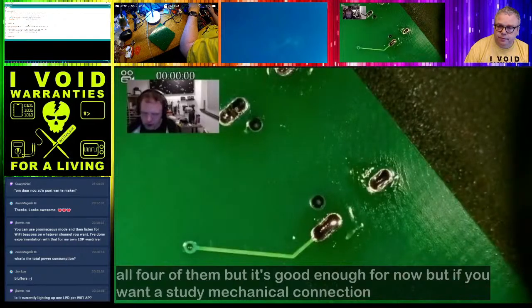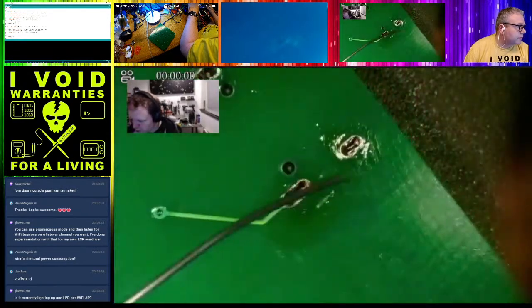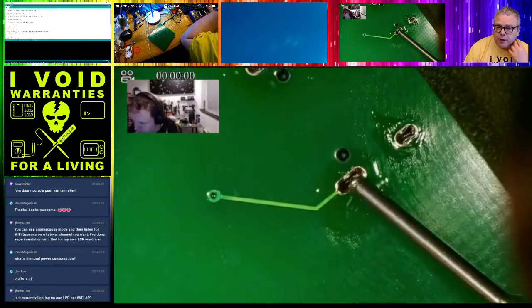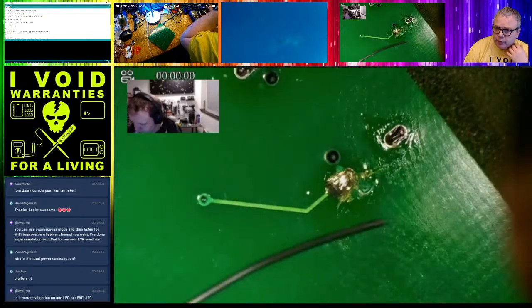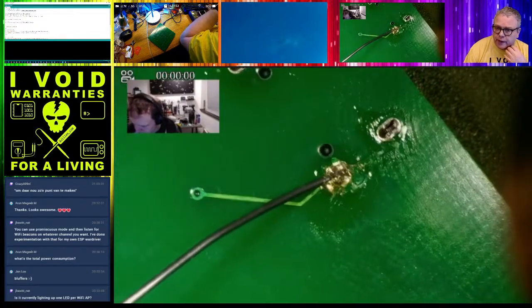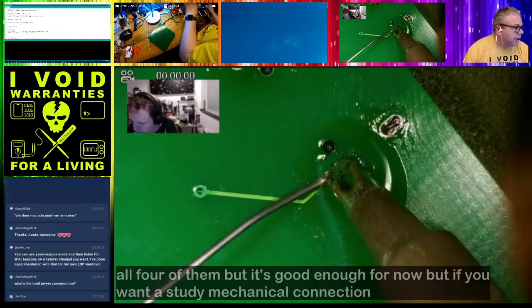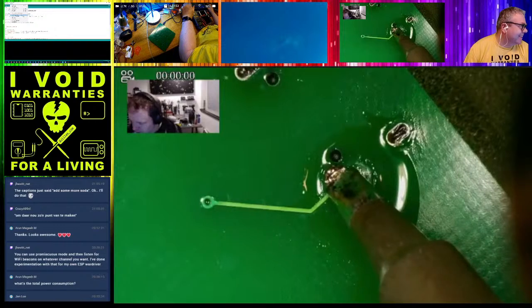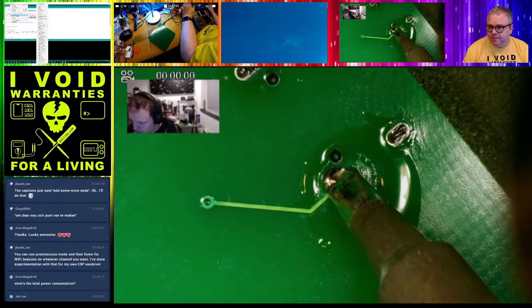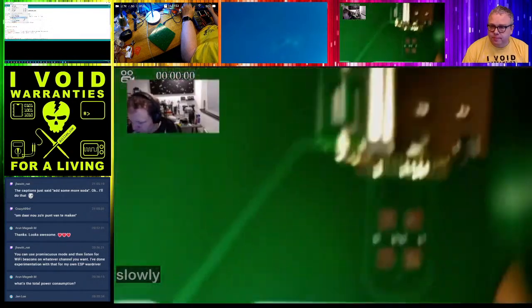And just more heat. The thing is that this USB-C connector takes some time to heat up, and then it'll suck in more solder. Yeah. And sometimes you just need to add some more flux, and you'll see it nice and bubbly. I sometimes run into issues where the holes are too big and it would endlessly take up solder, ending up to the side of the component. Yeah, that happens. Suggestions for fixing that? No, okay. That's just stupid design mainly. Okay. So you see it slowly bubbling and sucking up more. Yeah. So if we go and look at the other side now, it should.